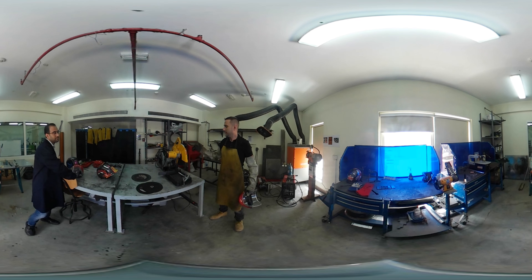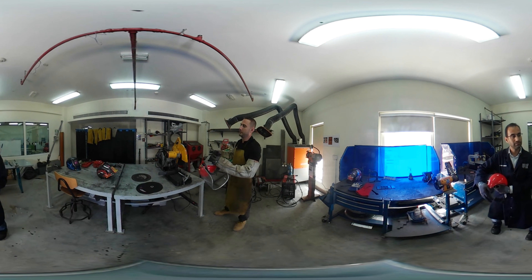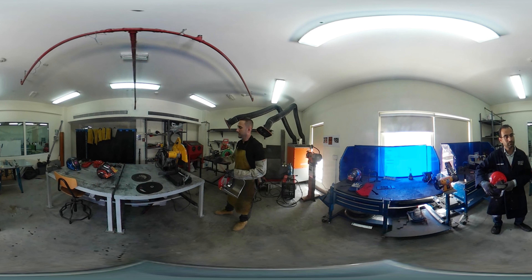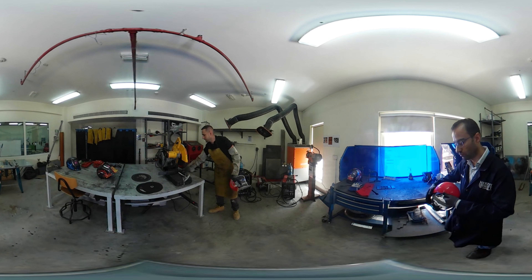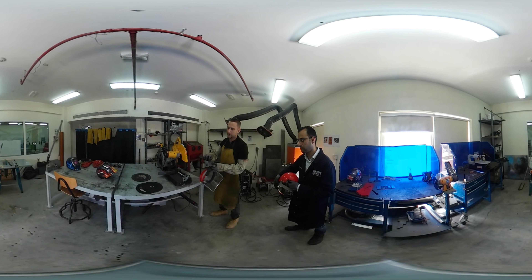As you can see, it creates lots of sparks. So before you cut, make sure the area around where you are working is safe, clean and tidy, with no rags or flammable liquids anywhere nearby. Now the material is cut off. You need to be cautious because it is very hot, especially at the edges. That's why I'm wearing protective gloves. Because it's a grinding disc, it has pushed all the metal out, leaving sharp edges — so before we weld, we want to prepare those edges and remove all the sharp marks.